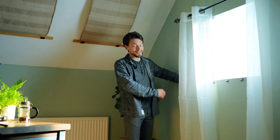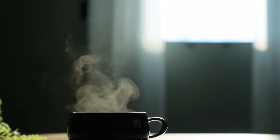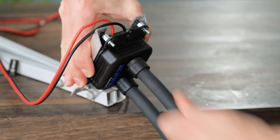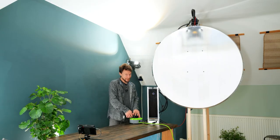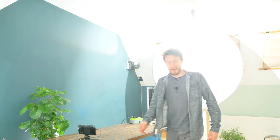DIY Perks has been making videos about building DIY video and lighting gear for a while now, but he's really outdone himself with this one — an artificial sun for filmmaking. Making an artificial sun is more than just getting the right brightness and color temperature. Sunlight also has near-parallel light rays because the source is so far away. To achieve this, he's using a 36-volt 100-watt LED element with its own liquid cooling unit, and then pointing it at a parabolic dish covered in reflective film to align the rays. This is a hyper-specific build, but there's a bunch of cool engineering in it, and it's great to see somebody just going for it.